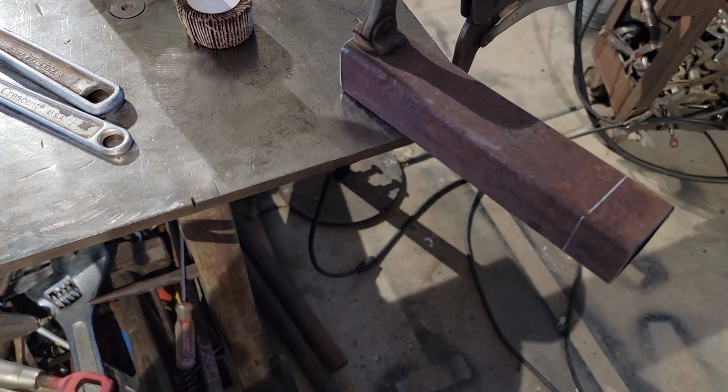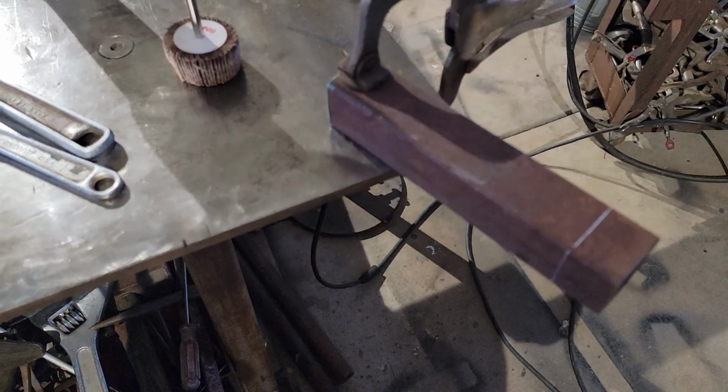I have my air compressor set to 120 pounds, because I figure if you're in a real shop setting, they're going to run all of their airlines at 120 pounds. I have an 80-gallon tank, and my air compressor puts out just under 16 CFM. That should be more than adequate to see what this thing is fully capable of. So let's put this thing together and give it a shot and see what happens.